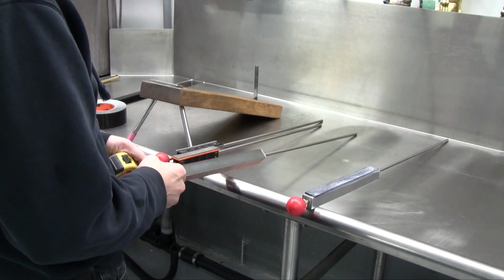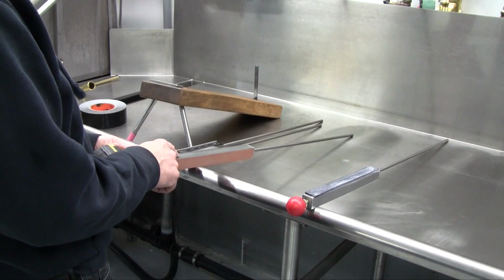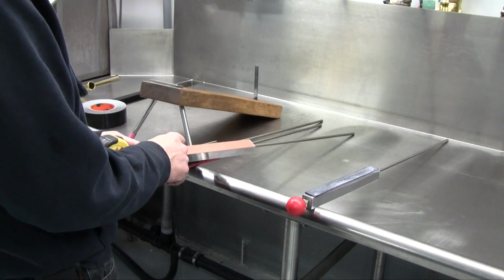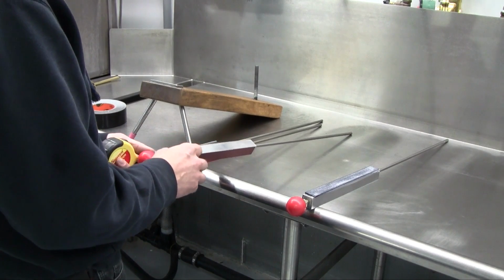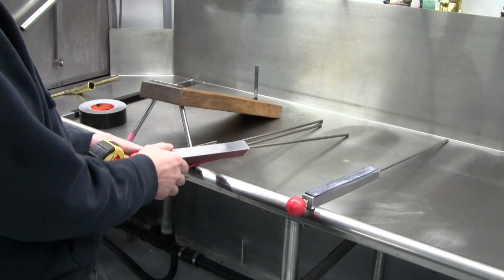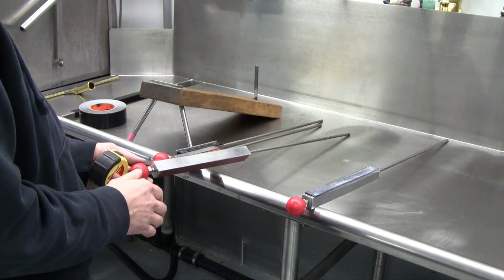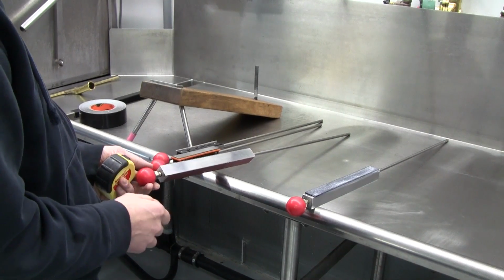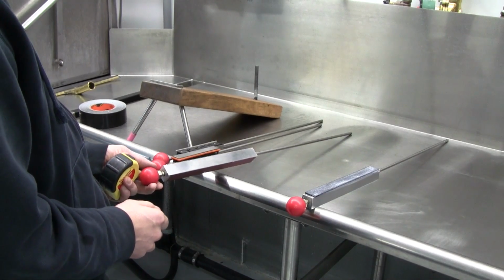So after the 180 grit, I will jump to 320 grit. Then I will jump to 600 grit. And then I will jump to 15 micron, which I'm out of. So I just ordered some from Lee Valley. And by the way, all the material here, I will put in the description, how much it costs and where I got it. I'll put as much of the material as I can remember where I purchased it from.